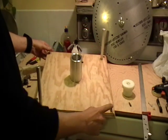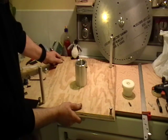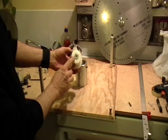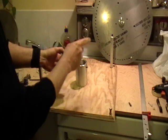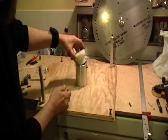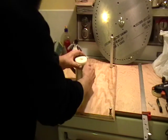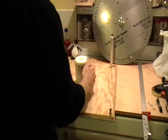These are leveling screws. This is the bearing holder. There's one of the bearings. We're not going to use that one right now because I'm showing the way that Milo had it set up at first, with just a little stub axle there that goes in the top. So we'll put that on there like that, and tighten down the little set screw to hold it in place.